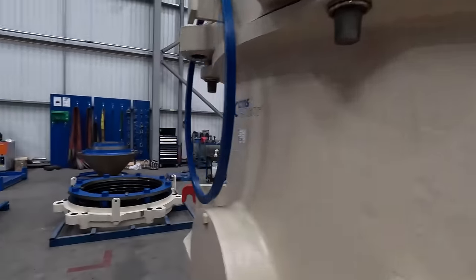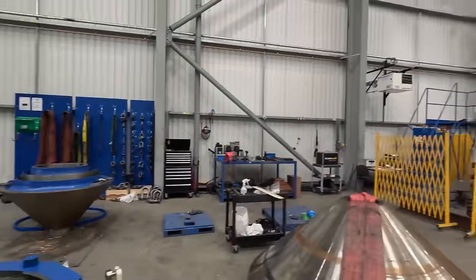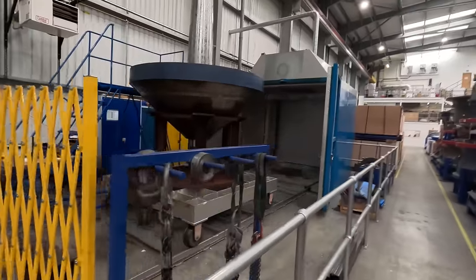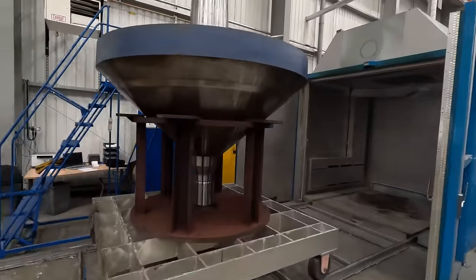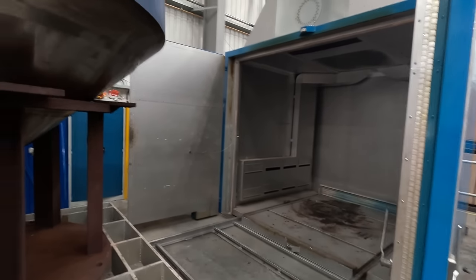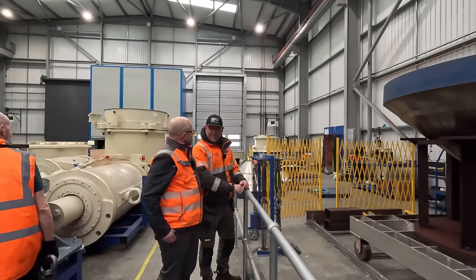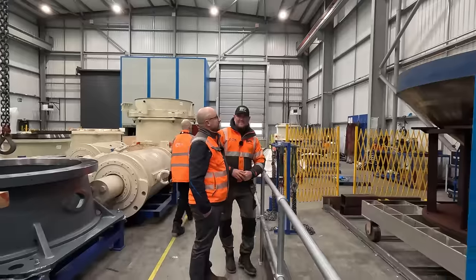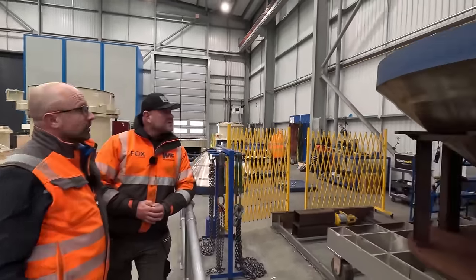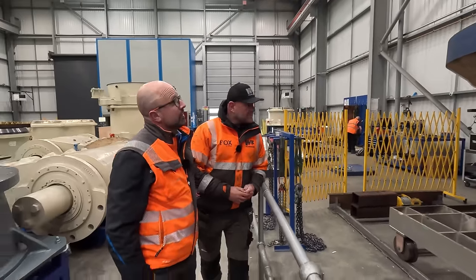This is one of the new ovens that we bought probably the end of last year. This is where we'll heat up your heads for your shafts. It'll be cooked for 10 hours up to a temperature of about 240 degrees, when the assembly guys will come in, then take some measurements with internal external mics. I can't feel the heat from here, so how long's that been out? Been out probably half an hour now. Half an hour. Right. So then that'll cool down, and that's probably destined for the States. For one of our, for CMS America.